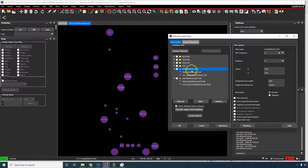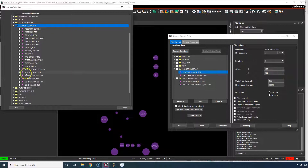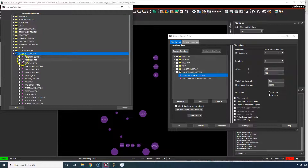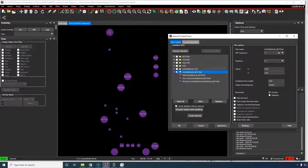You also want to include one more thing. Click on the pink thing, then right-click add — package geometry solder mask top. Sometimes you'll have something in the package geometry of the device that allows where you need to get that solder mask exposed. So solder mask top, click OK. Even if it doesn't show anything, it's a just-in-case type of thing. Again, if there are any packages on the board that need to have solder mask exposed, right-click on the pink thing — this is the bottom now — and go to package geometry solder mask bottom. Click OK.